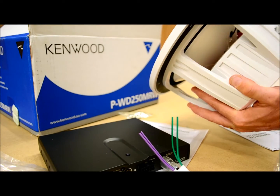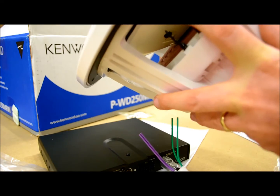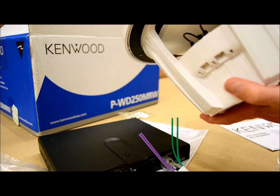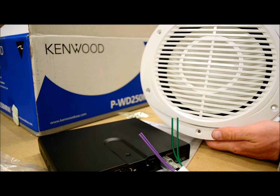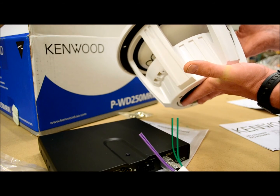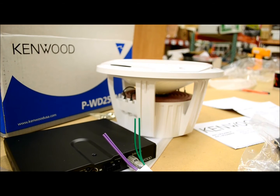The excursion on this thing is very nice — it's a stiff cone and very durably made. I've actually dropped these on accident and never cracked the basket. The tinsel leads going to the voice coil are not running through the spider, so there's a little extra slack. I like the stainless hardware, the sealed magnet structure, and the venting. On top it's very aesthetically nice. The overall cutout width is 9-1/8 inches. It's a nice beefy little woofer with good weight to it — not cheap at all.